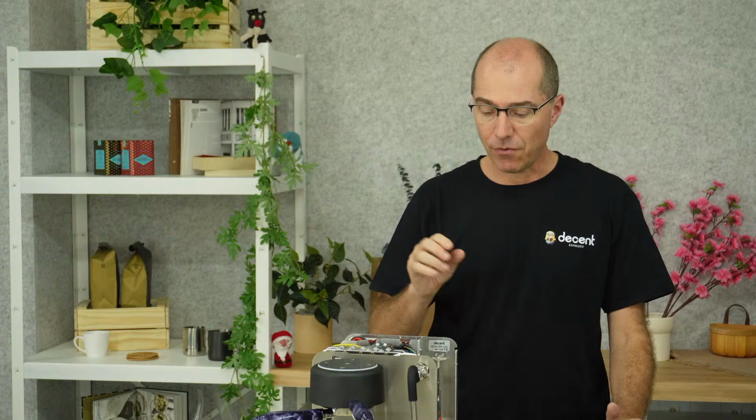One thing I didn't mention, I'll just put it in here, you can splice it in. In order to do pressure profiling and flow profiling, it's the same thing that we do for temperature profiling, which is to say, if we detect the pressure or the flow needs to be different, we just instantly put a few more cycles of electricity into the pumps or a few less cycles.